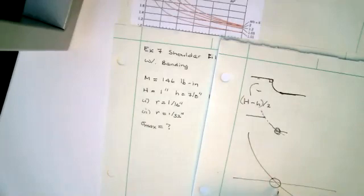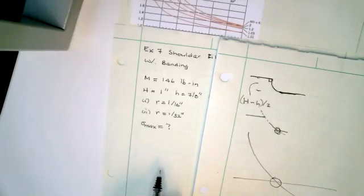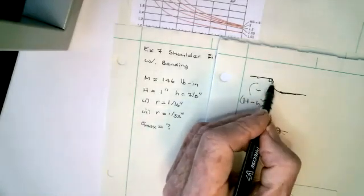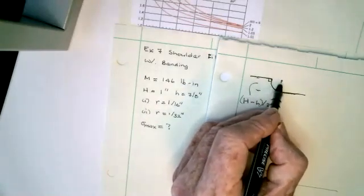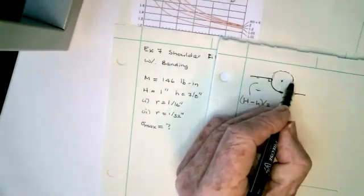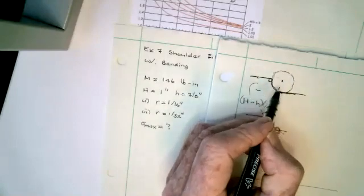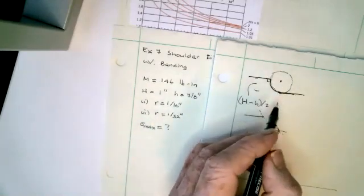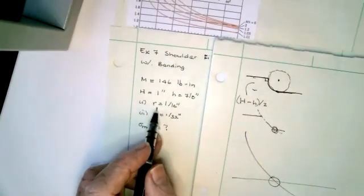That's a sharp corner. Very high stress concentration. So that's why you can't put in a bigger radius than this. This distance here, this is the biggest circle I can put in here. Okay. But with a smaller radius, you'd still be able to have it tangential to the bottom one. Yeah. So this one here, yeah, fine.